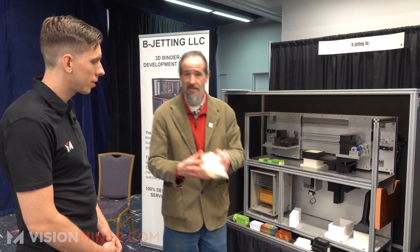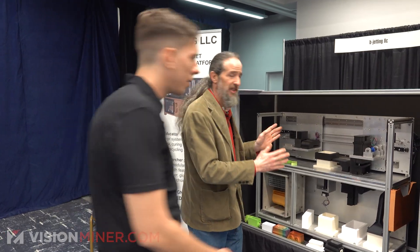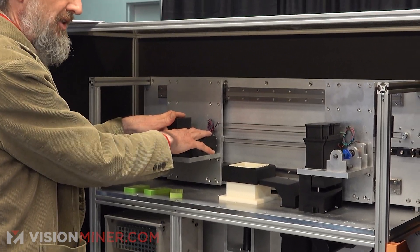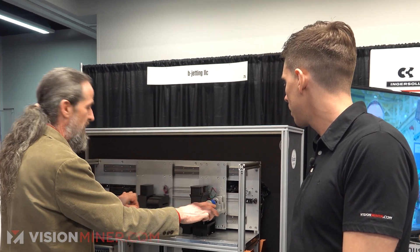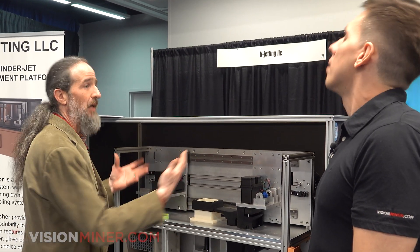It's a 60 by 60 by 60 millimeter cube. I can go all the way down to about 30 microns in layer thickness for some bigger particles. My very first customer is actually doing a glass-based system with really big particles — 200 to 300 microns — and I can do half millimeter thick layers. What I've come up with here is a five-slot deck. You can have up to five slots arranged in any manner. For a standard binder jetting machine, three slots are dedicated to spreading, leveling, and heating the powder, and two slots are dedicated to the actual printing and randomizing the print head location.